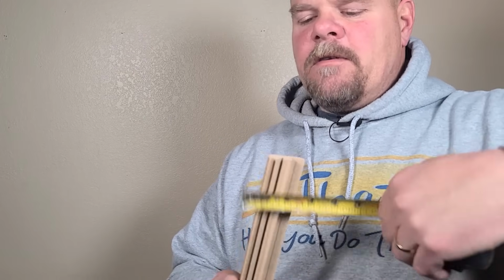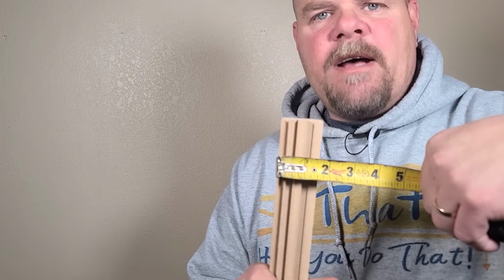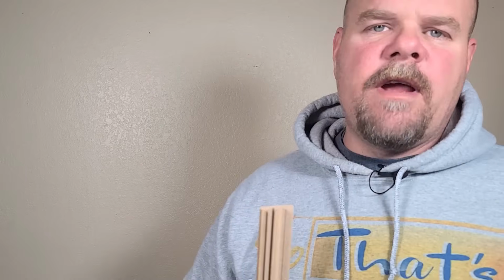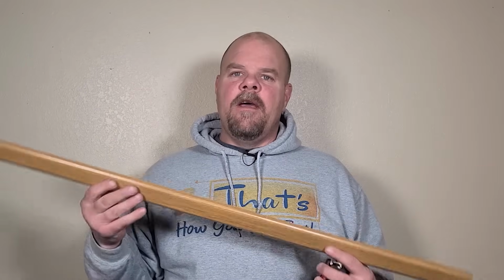So I would just measure it, and that's where you're gonna come up with the number and come like 1/8 to 1/4 inch past. So we would wanna leave like 1 1/4 inches of a gap. If you look in here, you can see 1 1/4 inch gap is about what I'd want to leave for this particular end cap. And these, every manufacturer is going to sell this type of transition.